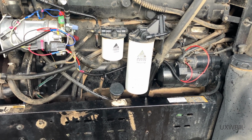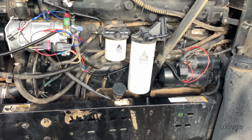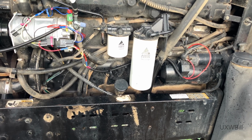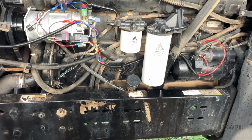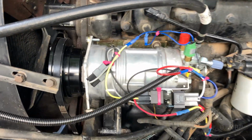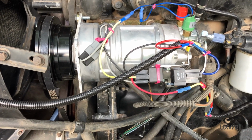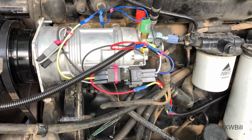We've got just shy of 3 pounds of refrigerant in here. We cleared the sight glass. What we've got now is so much more like an air conditioner than what we had. Had about 50-degree air blowing from the vents in the cab with about an 84-degree ambient or thereabouts. I am a little concerned by the amount of vibration that's going on here and how that's going to affect those relays over time.